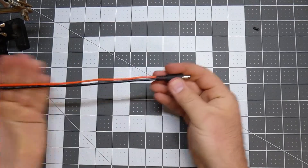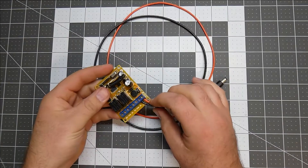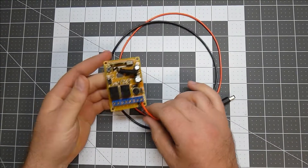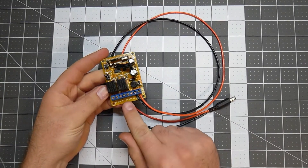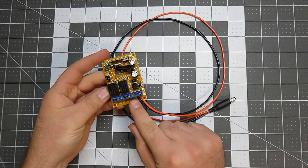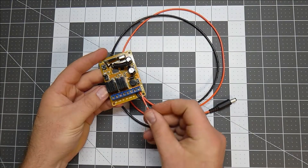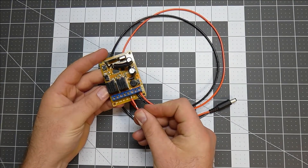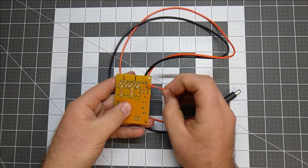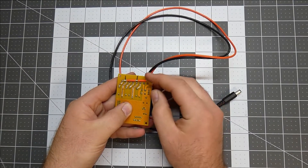There we go. I went ahead and stripped back the other end of this wire and terminated it on these two terminals for plus voltage and ground. The next thing I need to do is provide 12 volts to the two common pins of these two relays. There's really not enough room to stick a wire in here and go from this 12 volts to this 12 volts, so what I think I'll do is solder a wire from the 12 volts pin to the two common pins on the back side like this.